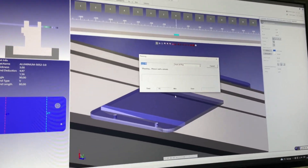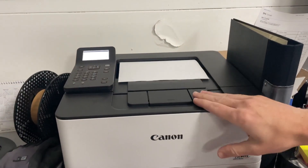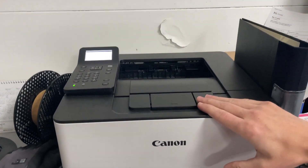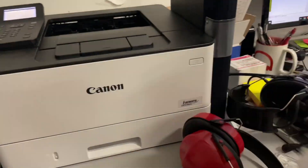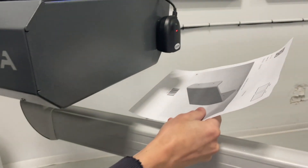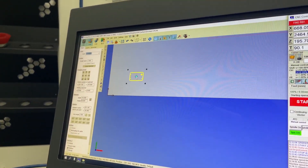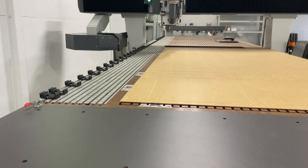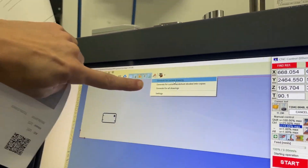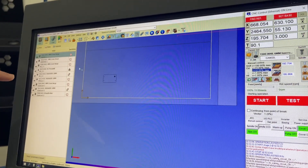There goes the printer. We're being ISO certified so I've added a bunch of stuff on the backside, but ignore that for now. We got our part, a picture, dimensions, and paint info. Press import. All we need to do is scan the part — it's already on the table. We need to put it a bit higher up because we have traces in our spoil board. Generate for current drawing — BAM, all our stages and G-code are now generated. Control F5 to refresh them.